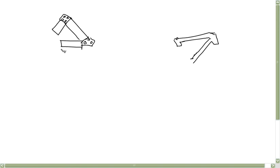Okay. Anyone have any questions about that? Yeah, I'm glad to bring that up because that's sort of an important thing in all our discussion of structures and trusses. The trusses that we talk about don't look like the trusses that are built. Our trusses have pin joints, and you would never see a bridge with pin joints at those things. For one thing, they're probably too expensive and too hard to put together.